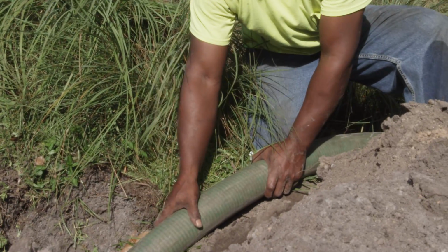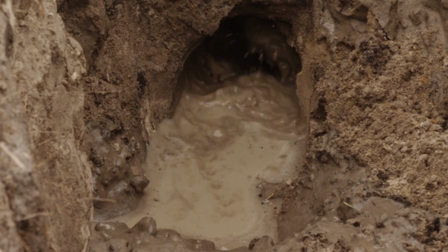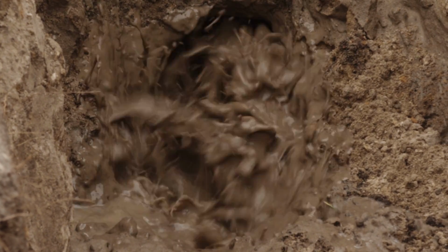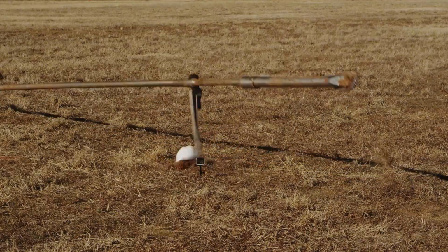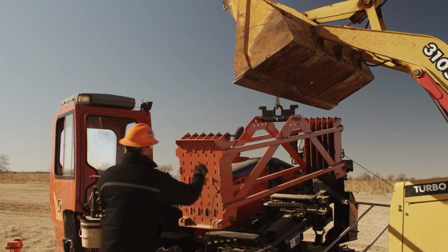The most serious hazards associated with HDD include utility damage, rotating drill pipe in front of the machine or any pit where drill string is exposed, rotating tools, back reamers at the exit pit, rotating product, thrown pipe wrenches, changing pipe boxes, and manually adding pipe.